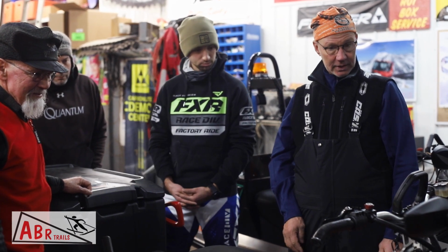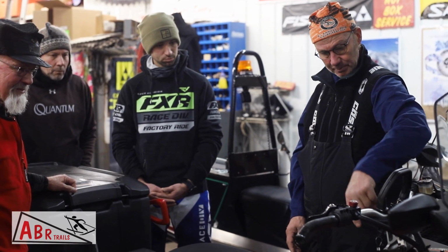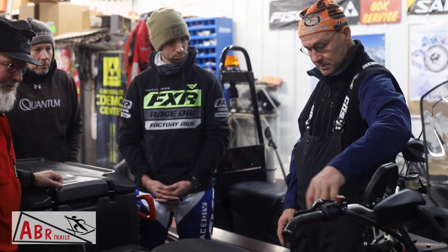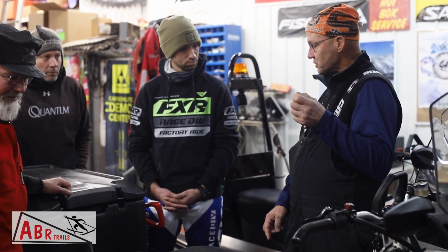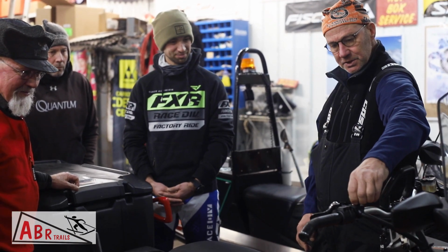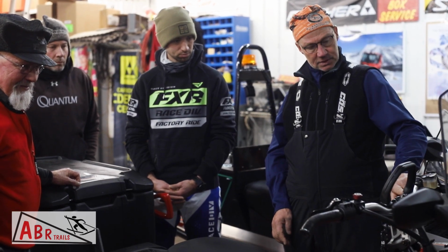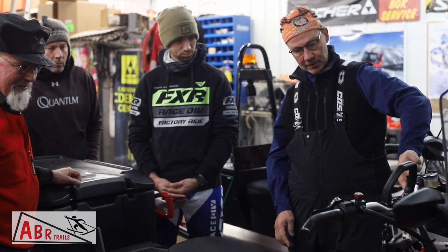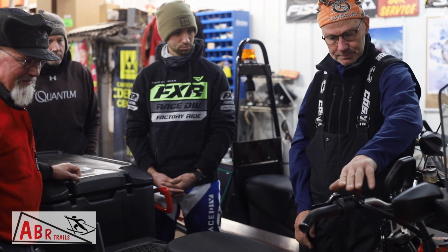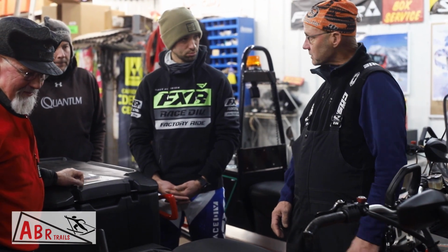It's got the 900 Ace in it, fuel injected. There's no key, there's just a safety tether, so make sure the tether's on. We don't attach these to our body. They're meant to shut the machine off when you fly off it, but we're going pretty slow. This is the kill switch. That's how you turn it on and off. Pull that out. And then this is the start button. You just hit this to start it, and turn this off to shut it off.